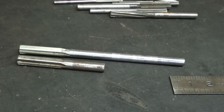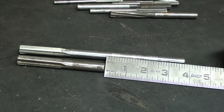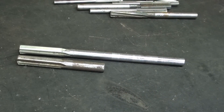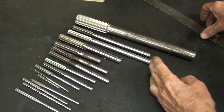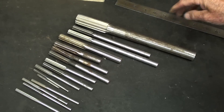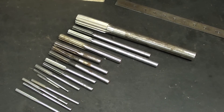It was Bubba that cut all these reamers off. But these are both half-inch reamers, and look at how much shorter the stubby one is — it's a full, almost a full four inches shorter than the regular chucking reamer. So this gives you a lot more convenience when you set this up in a drill press or a mill. As reamers get larger in diameter, they become outrageously long — this one is ten and a half inches long. And that's a problem on a lathe too, as far as backing up your tailstock. So that's part of what this video is about.